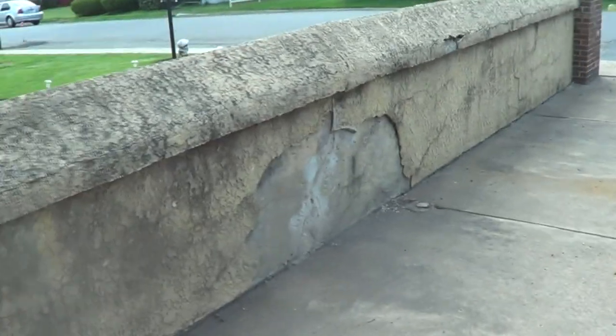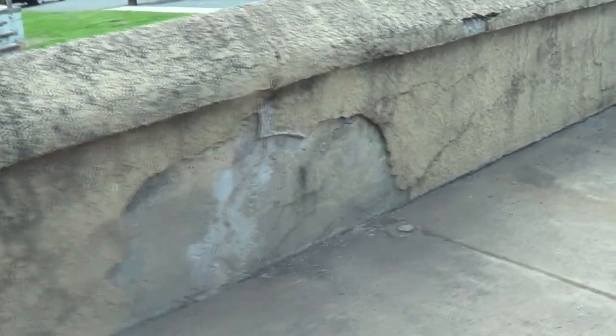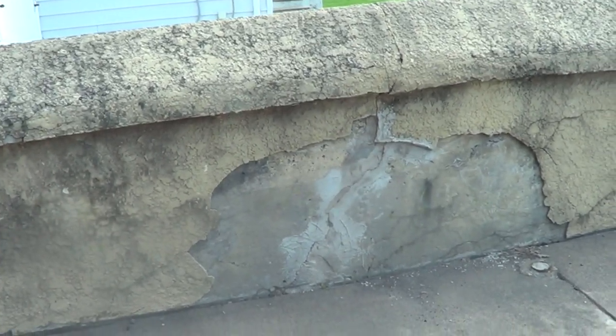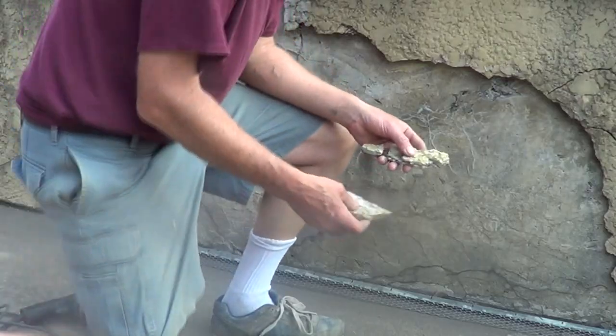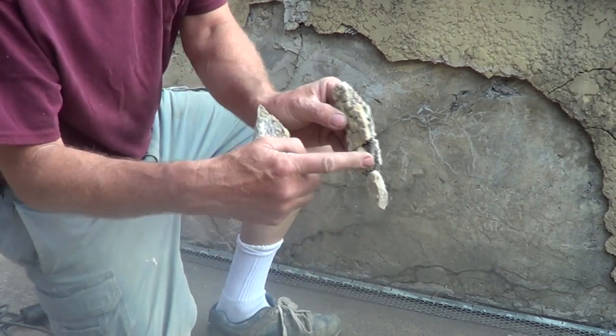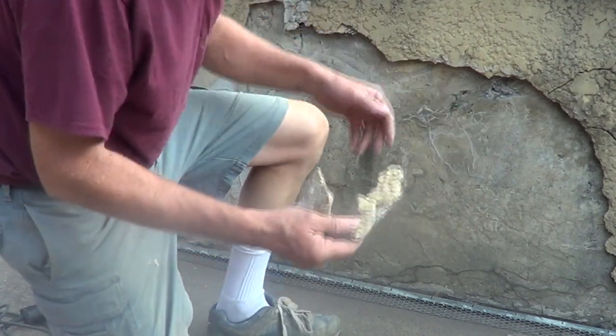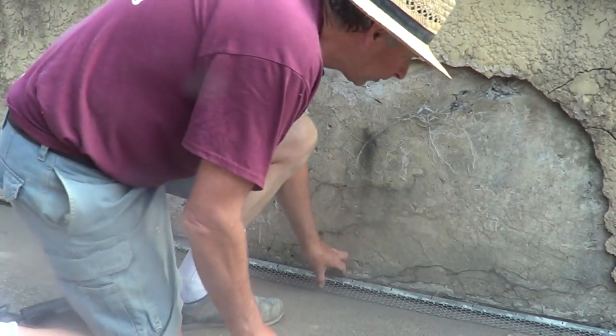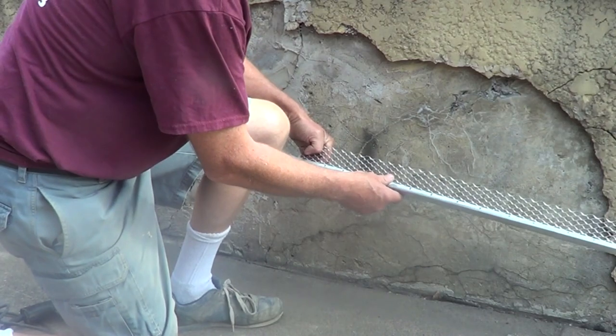No wire or anything. You don't have to use wire all the time, but when you've got a patch like this and a crack like that, we're going to use wire. So I get there and look in here and there is wire in it — see the wire? I guess the wire rotted away and it broke off, so I was wrong about that. But I'm going to use this as a starter strip for stucco.